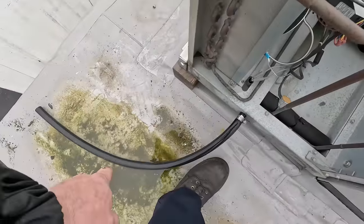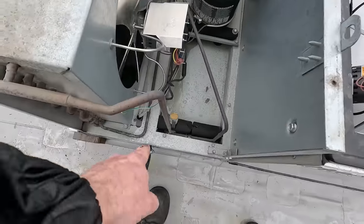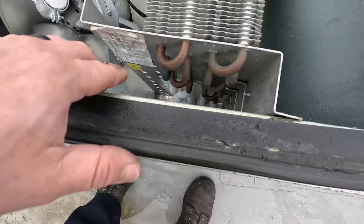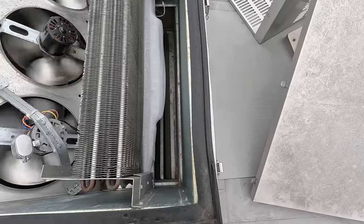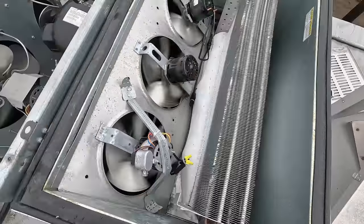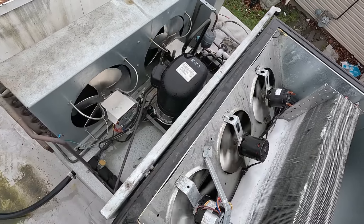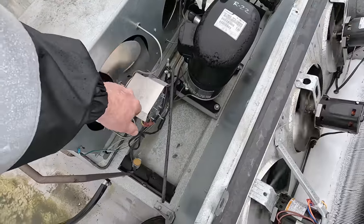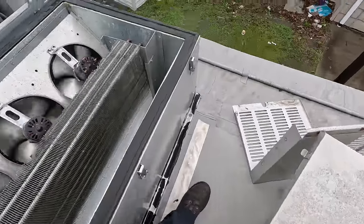Taking a closer look — here's that drain line. They put a rubber roof on this thing not too long ago because they were having issues with things dripping through. So it comes across, and you usually have a problem with these not draining very well. That pan is pretty empty. We're going to go ahead and try to melt this out here first. This part is going to be tricky because some of it's going to fall down. I may try to chisel off what I can without hitting the coil and then give the owner a call back to see what he wants to do. If he wants to swap out the electronic control, I don't carry that on the truck — we usually carry the basic stuff and order what we need.